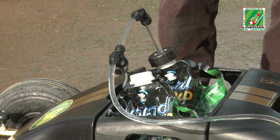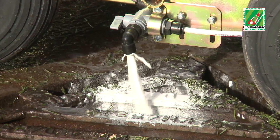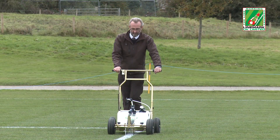The on-off button is pressed again to allow the paint to be pumped into the pipe. The pump will first expel the water in the pipeline, and when paint emerges, the on-off button is pressed once more to stop paint flow. The striping can now begin.